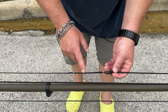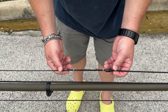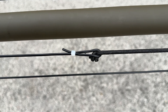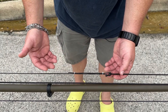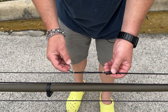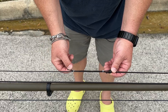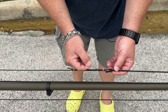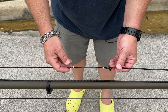He also talks about foldbacks. This is the 20-meter element with about a six or seven inch foldback. I didn't really have much of a foldback on some of the other elements. Here's a look at the 17-meter element, here's the 12-meter element, and here's the 10-meter element. The 10-meter element actually had more of a foldback than some of the others and it's perfectly in tune. Some ways you can tune this: sometimes I've just trimmed off a little of the waggly bit if I need to cut a little. Other times I've had to cut these off and lengthen or shorten, basically making the loop in a different place and reattaching new zip ties. This way works great for me.